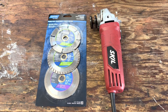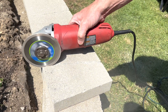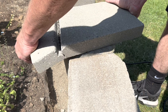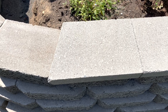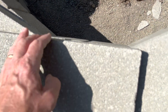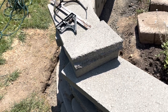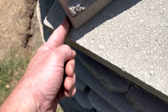Here's what I'm going to use for cutting these cap stones for my wall. I've got this piece fit up where I want it — flush with the back side — and I'm going to come all the way along here and chop this off. For the next piece I'll score it along here with the chisel as well.